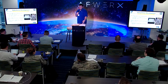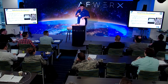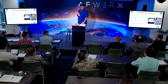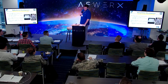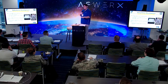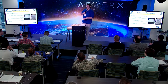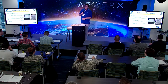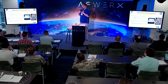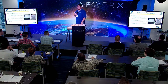What he's done is he's taken ceramic balls, which are an industrial product. They're actually a precursor to ball bearings, so it's not a specialty product by any means. Buy the balls, put them in a mold, spray the mold with a foam. The foam holds together the balls. You flip it over. You put polyethylene, the same kind of soft armor that's backing the current plate, inside the foam, behind the balls. Spray another layer of foam, let it cure, and then it holds together. So it's essentially the same idea, a ceramic strike face backed by a soft armor, but because of the foam and the ball construction, it's flexible. It can move around.